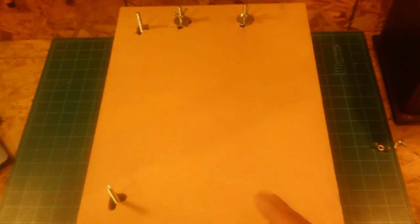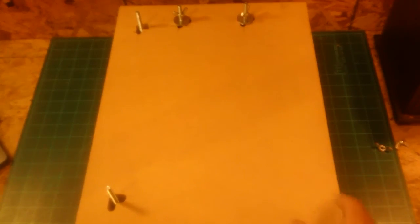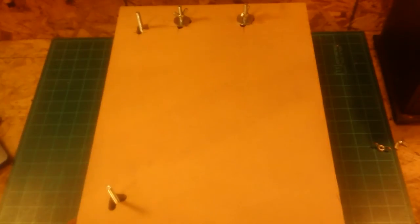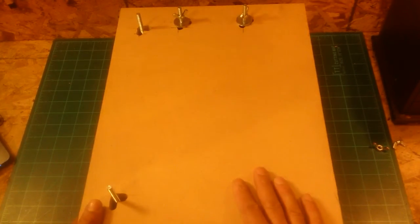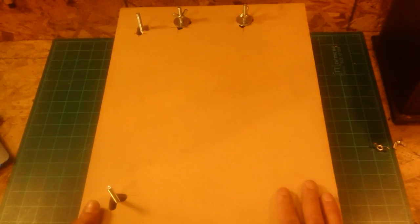I think the temperature is 270 something degrees or 240 degrees or something to get Kydex to really where it'll mold nice. Sometimes a little hotter. But if it'll do that, then your foam's fine. So before I went ahead and glued this foam to this piece that I made, I did that test. I cut a little corner off of the Kydex, that way I didn't waste the whole sheet. And then I hit the heat gun to it, and it rolled over. It was real hot, peeled it up, and no foam stuck on there, so I know it was good to go, and I went ahead with this foam.